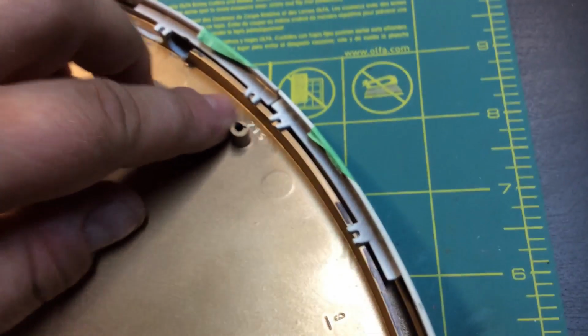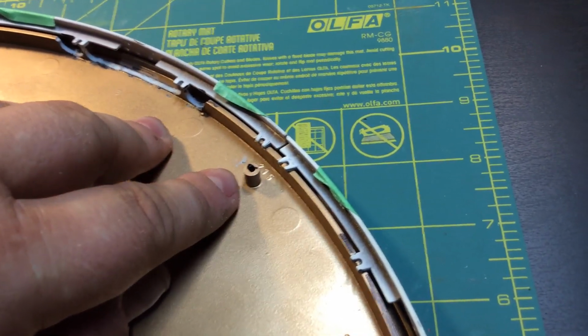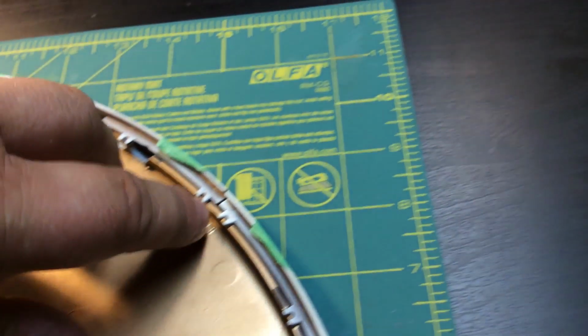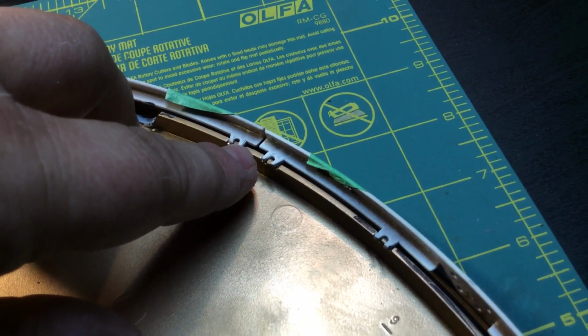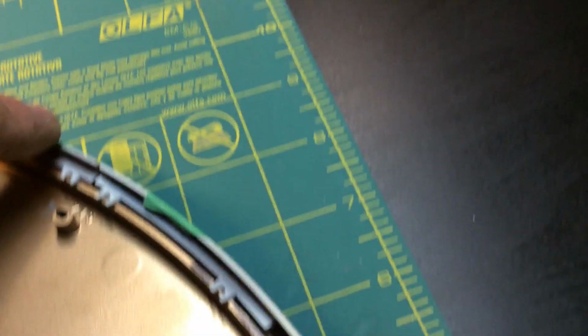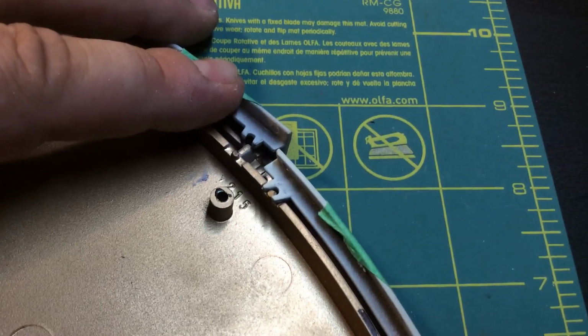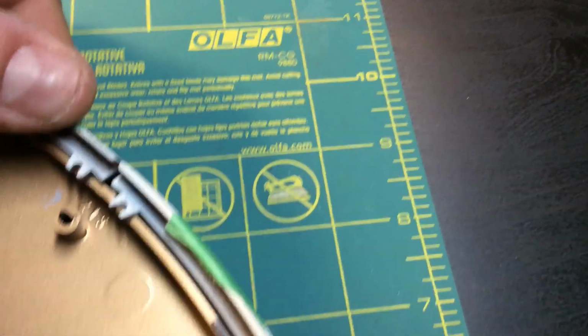Now, the other prep we need to do for this is for the bulb that goes right in there in the reaction control thrusters, so right behind this. Now, instead of grinding that down, you don't want that yellow light leaking out because it's a yellow bulb, because the reaction control thrusters are yellow. So what we're going to use is a 3/16 drill bit to drill a hole through this wall right there, so that the bulb will fit through, and then this all acts as its own light blocking box, basically. Keeps everything in there really neat. Because if you look, if you pull this away, where the peg is, that'll also act as light blocking. So it's a really good setup they got going on.